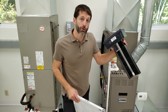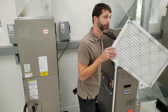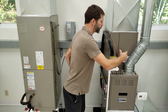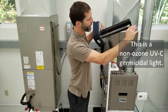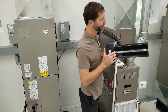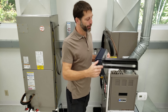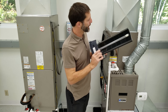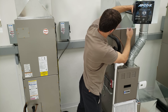I want to explain why we're installing this into the supply side duct. A filter is installed in the return side of the duct to stop particulates from traveling into the gas furnace heat exchanger and to the bottom of the evaporator coil where it can get clogged up. The UV light here is going to kill any biological issues that may be growing on the coil, such as mold and bacteria. It also treats the air traveling through and handles any type of odor and VOCs. We're installing it up here so the UV light can shine down the whole pathway and on top of the coil.